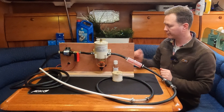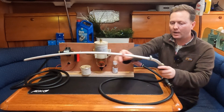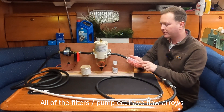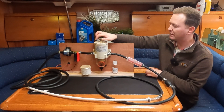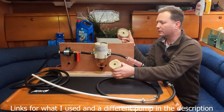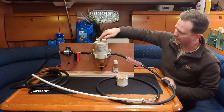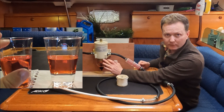Let's check out what the fuel filter looks like. It starts off with a semi-flexible tube - this is speed pipe - and then it goes onto a hose that goes into a little hand pump siphon. There is a little black arrow to tell you which way it's going to go. Then it goes into a sieve, which is going to get rid of a lot of the large debris, and then it goes into this Katsu filter, which is basically a copy of a Raycor filter. I've put a link in the description - the replacement filters are only about £5 each. It is also a water separator, so as the fuel goes through, you might see water collecting at the bottom because the fuel will float above the water.